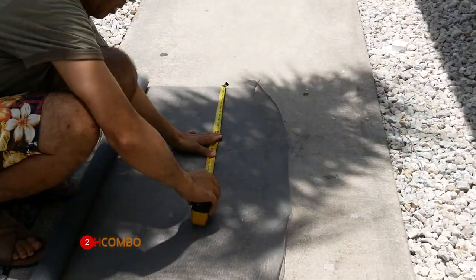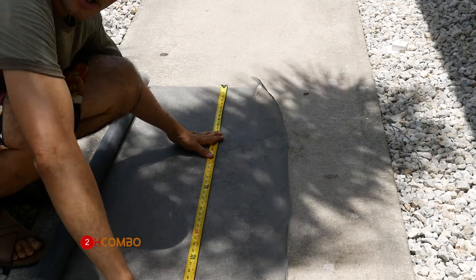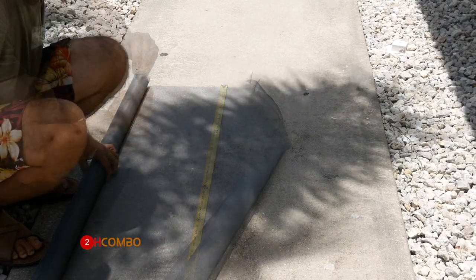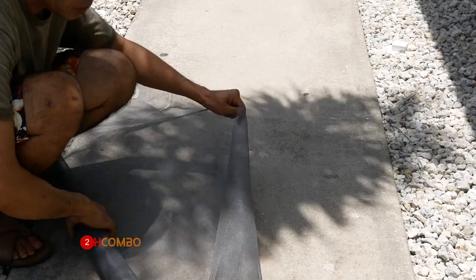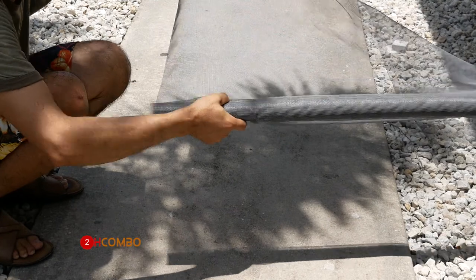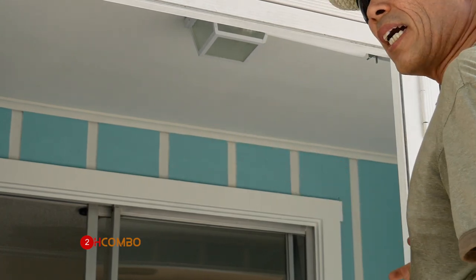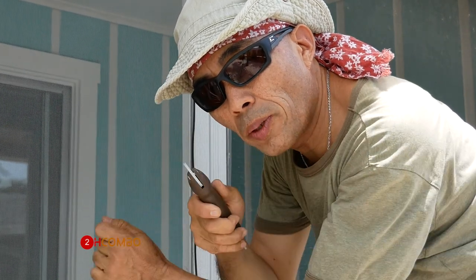This screen is 47 and a half inches wide — I only need 41, so I'm not going to cut the width at all. I just cut the length. I said 33 by 41, so I need to cut to 41 or 42, just to make sure I have enough. I think it's best to start from the top, then do the sides, then do the bottom. You want to make sure it's tight — as you insert the rubber you pull the screen and insert the rubber at the same time, that way the screen stays tight.